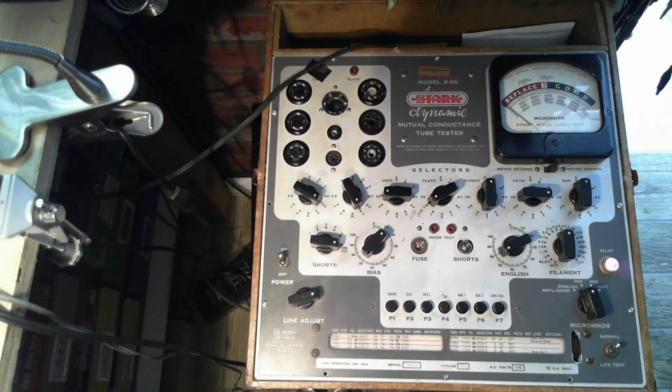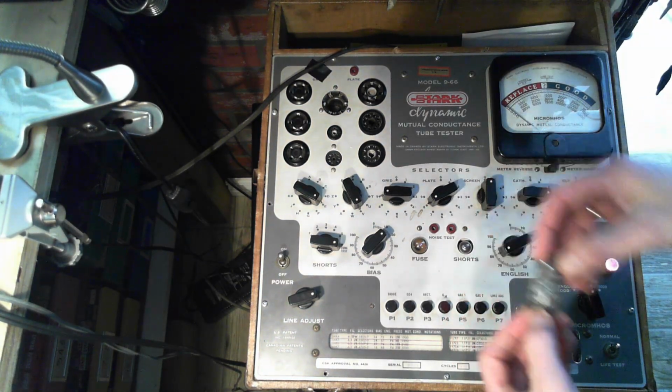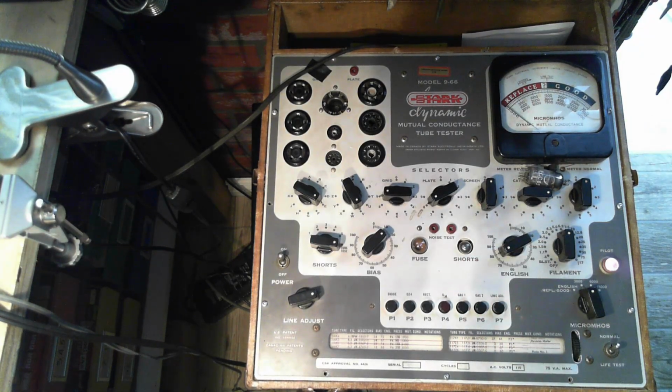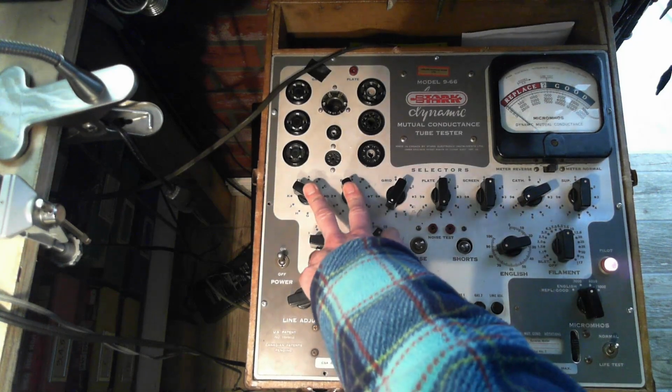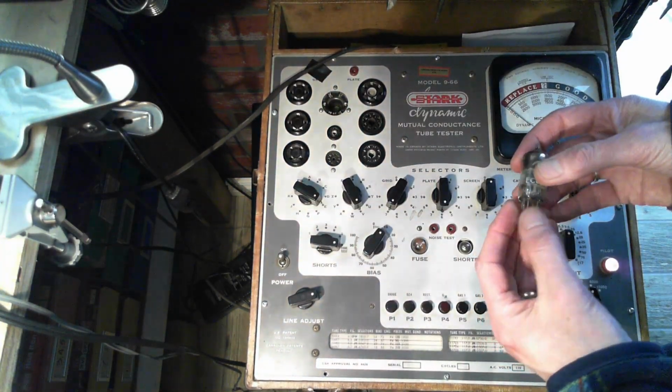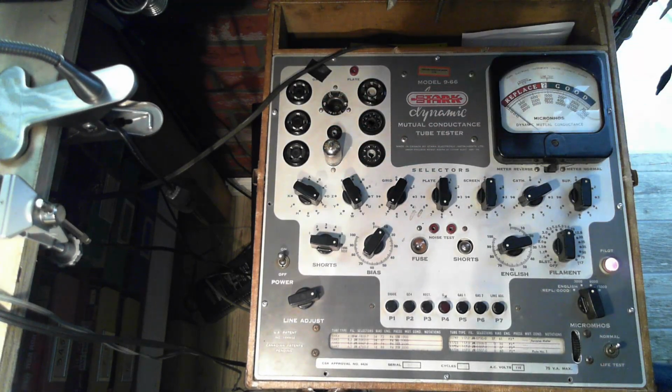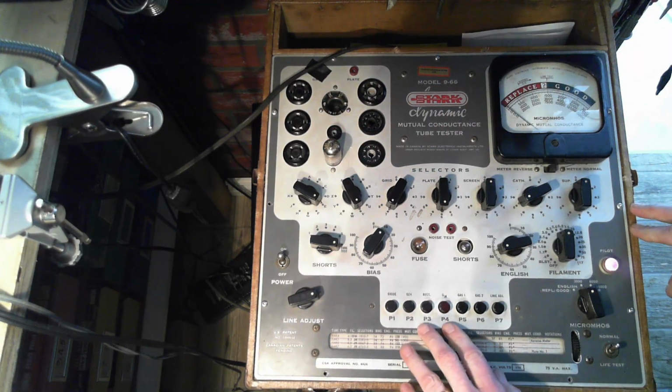So we got one that we're not sure about and one we're pretty sure about. And the last one to check is the FM tube, the ECC85. Okay, I gotta get the settings for that tube tester for that tube. On this tube tester, as soon as you get these two set correctly, the filament settings, you can plug the tube in and get it warming up. That's an efficiency move for someone who's testing many, many tubes.